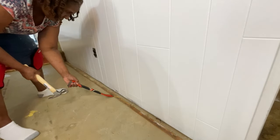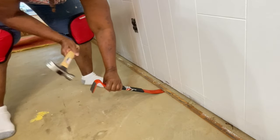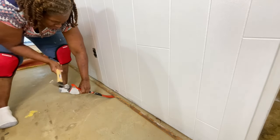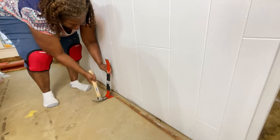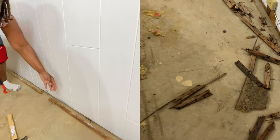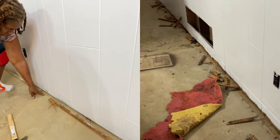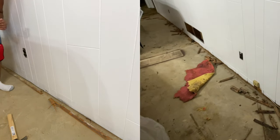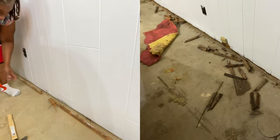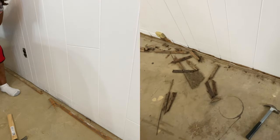After you've swept your floor very well, you want to get up these staples. So you're going to take this nice little staple remover. Concrete coming up like I just did. You want to get them up like that without any of the concrete and go all the way around, get those up, sweep the floor, and you're going to be ready to put your vinyl down.